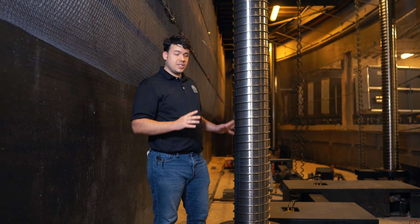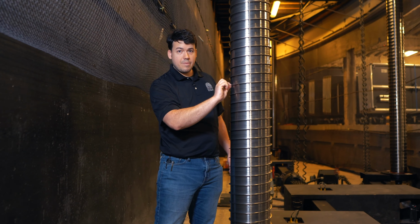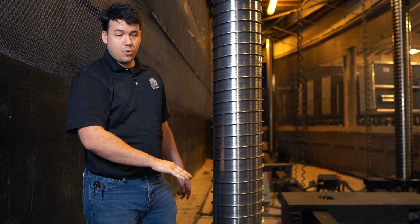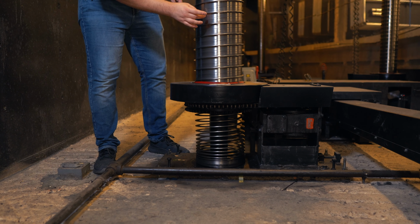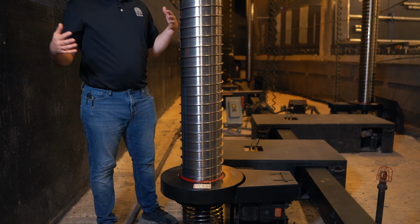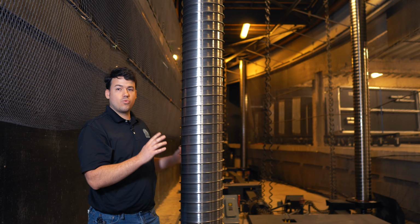This is not a hydraulic system. There are not columns that go down into the ground. These columns are actually hollow and they are comprised of 2 pieces: this horizontal thin band and these thicker bands. And what happens is as it lowers, the thin band you can see separates here, basically like a slinky, and the thick band gets coiled up inside this drum. And as it goes out, those 2 systems form to make a very strong, rigid structure.